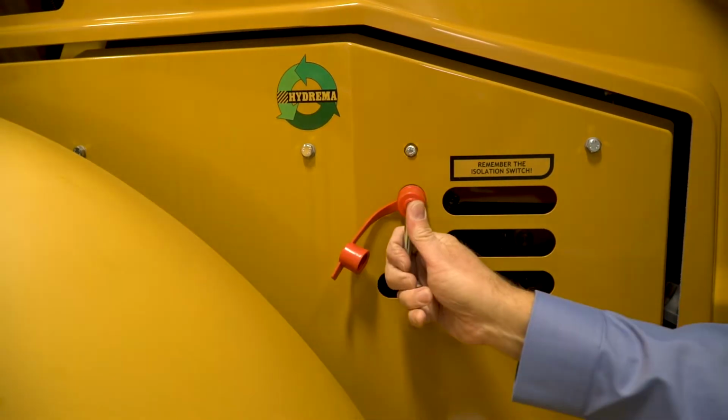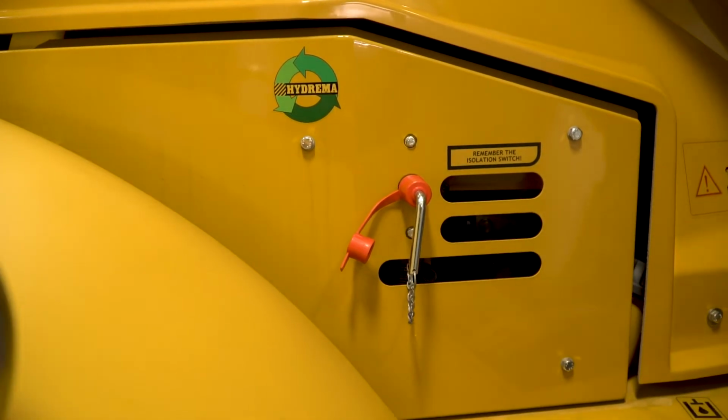Now that the battery compartment checks are complete, we need to engage the battery in the truck. So we'll turn the battery switch to the engaged position. Now the truck is energized so we can start it. One word of caution, after you've operated the truck, if you want to disengage the battery, wait 2 minutes before you do to allow the DEF purge cycle to complete. If you don't do that, you're going to get a check engine light the next time you start the truck.